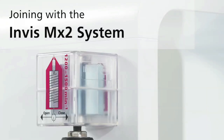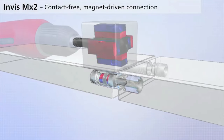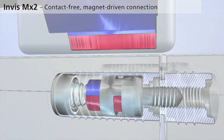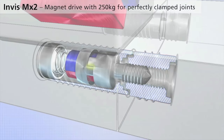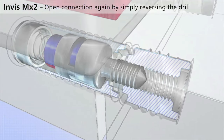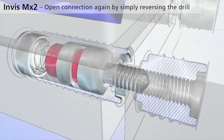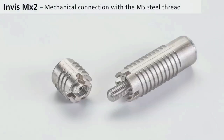Basically, the outer cube lays flat on your wood and does not turn at all. What happens is the magnet on the inside turns. If you have your drill going forward, it tightens the screws into the piece. If you want to unscrew or loosen it — maybe you need to make an adjustment — you just throw the drill in reverse and it opens back up. That entire cube doesn't turn, just the magnet on the inside rotates, so there's no marring on the surface.